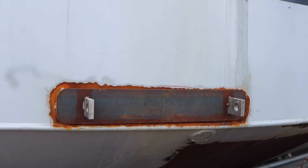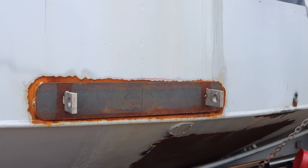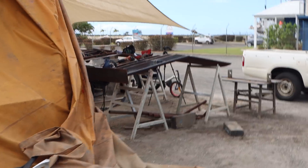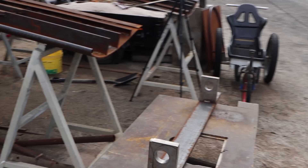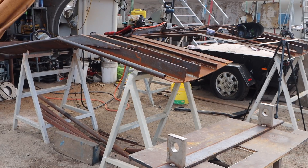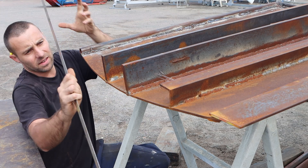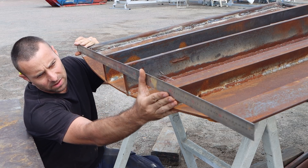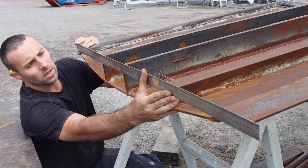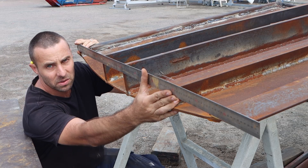So I've taken the wing part of this hinge off — you can still see those stainless hinge plates are just tacked there, from the fuel processor last week. I've got it down here and I need to start mounting it onto this end of the wing. But this is where alignment really becomes critical, because this affects the angle of attack of these wings. I'm thinking about using a straight edge to go between the trailing edge and the side of the leading edge, and use that as my flat plane to align the hinge.